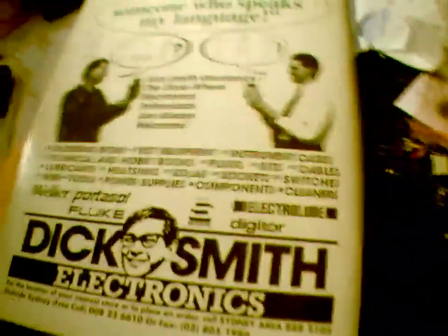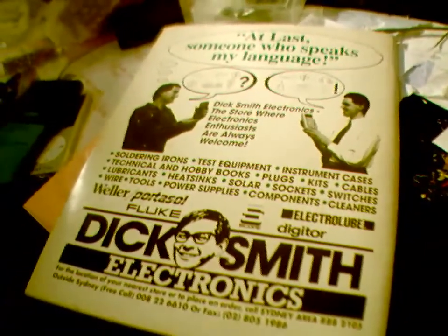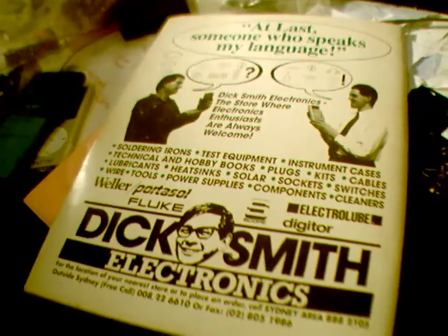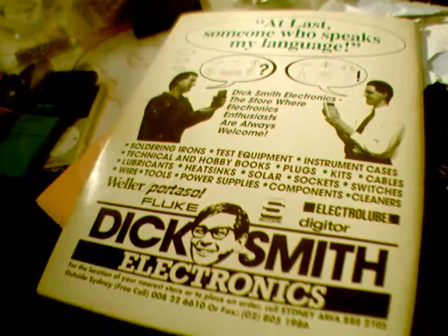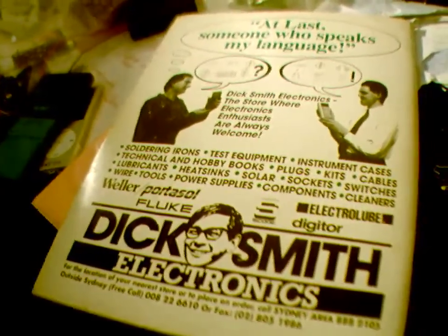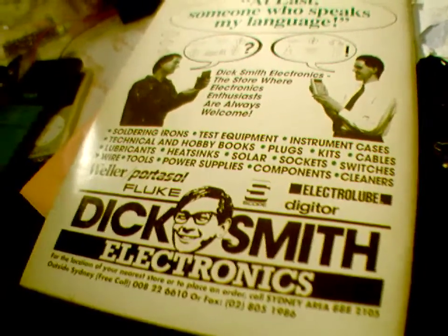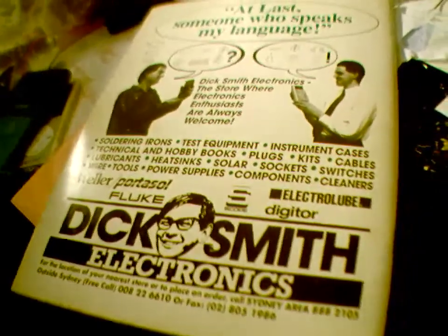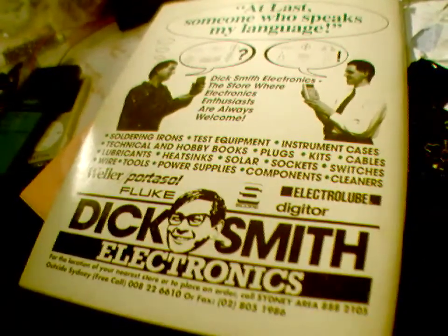Love the Garand transmitter. Well, that transmitter is actually no more. It was a VXO controlled CW transmitter for 7 megahertz and direct conversion receiver. And I can't remember, I think I only used one crystal. I didn't know about the super VXO then of 2 crystals in parallel. But yeah, used one crystal and could pull it about 15 kilohertz.